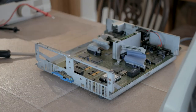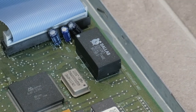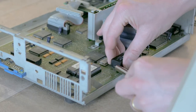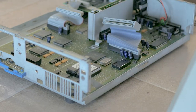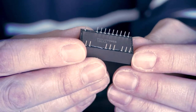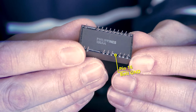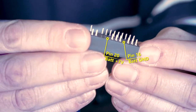If you open up the PS1 and remove the drives and drive tray, then underneath you will find the DS1287 socketed on the motherboard, often braced with a cable tie that you can cut. If we gently lever the chip out and take a closer look, we see it's a DIP24 package with a few missing pins. The missing pins are internally connected, including what would be pins 16 and 20 — respectively the ground and positive 3 volt lines that are directly connected to the internal lithium coin cell battery. Inside the solid block of epoxy lies an actual coin cell battery, a crystal oscillator, and a DIP24 chip with some of its pins bent up.